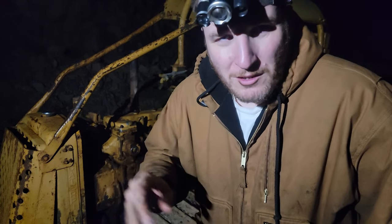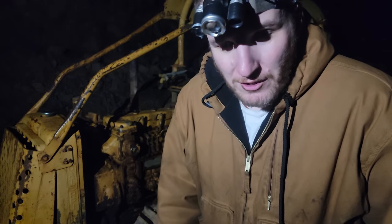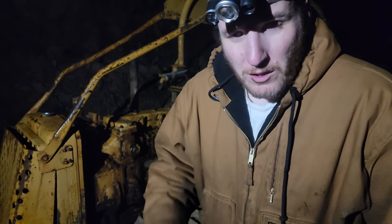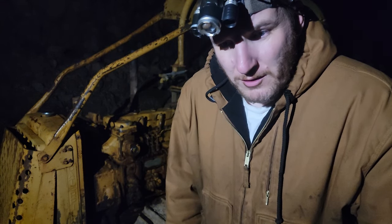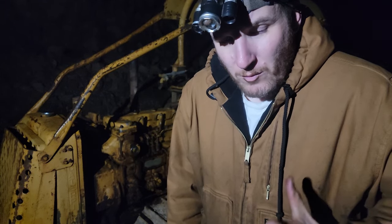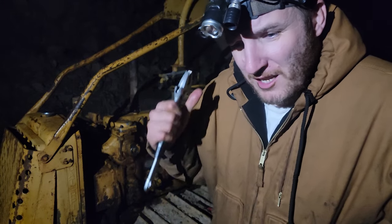We got the spark plugs in nice and clean with the torch. I flushed out the oil on the pony because it did get flooded for some reason. Seemed like it wasn't getting gas, and all of a sudden it got a bunch of gas and flooded out. So I think it's really easy to flood out because it has a really weak coil. So check the spark on the plugs. They're sparking great. So I think they were wet fouled, and with the new battery on there, I'm pretty sure it's gonna fire now. So I have the intake off just in case.